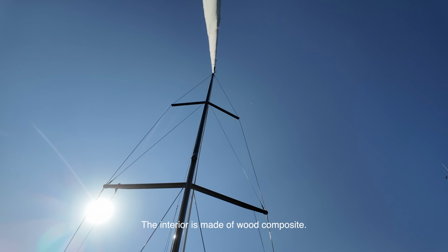After some sanding, he laminated the inside of the bow and the stem. We do 4 layers of fiberglass here as well, but Johan laminated 1 layer at a time. The stem isn't made from cedar wood, but from solid oak. This makes it extra sturdy and strong.